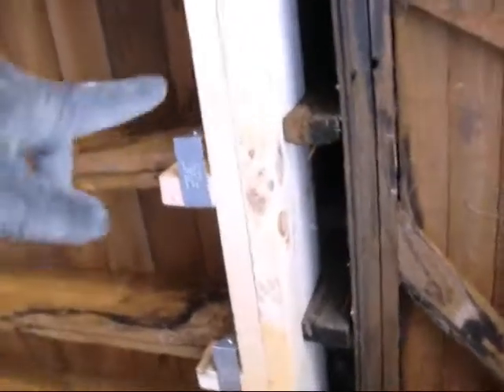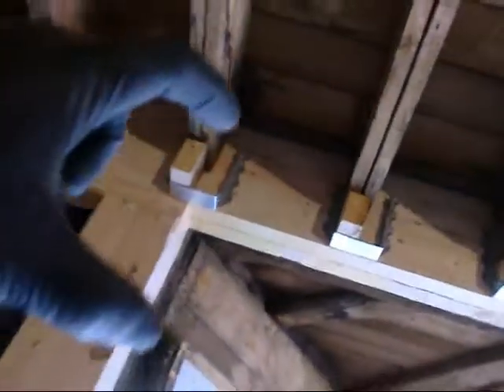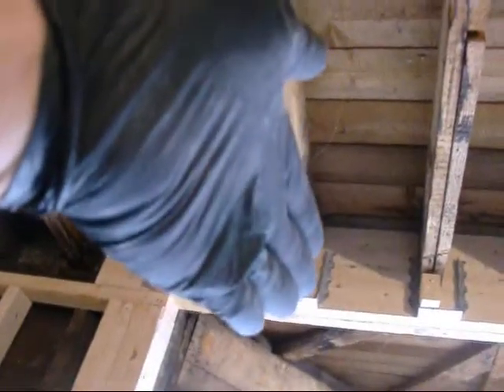We'll get one of your jacks, crank it up. We took away our wall in front of the bay window because now we got it supported. We had to cut where these floor joists attach to the wall, which was not done properly in 1888, but we will fix it up. We got a header across the top attached to our new wall, so we have a double layer of insulation in here. We blocked the seven-inchers with three inches of blocking so the two-by-twelves will fill up that joist hanger completely. We're going from crappy one-by-sevens to two-by-twelves, plus these original one-by-sevens, and joist hangers on a header, on a wall, supported in the basement by stone because you've got to transfer your load. Do it right. We're going to fill these joist bays either with fluffy insulation or maybe put some foam in because we have some water problems here that I'll have to address after the upcoming snowstorm.